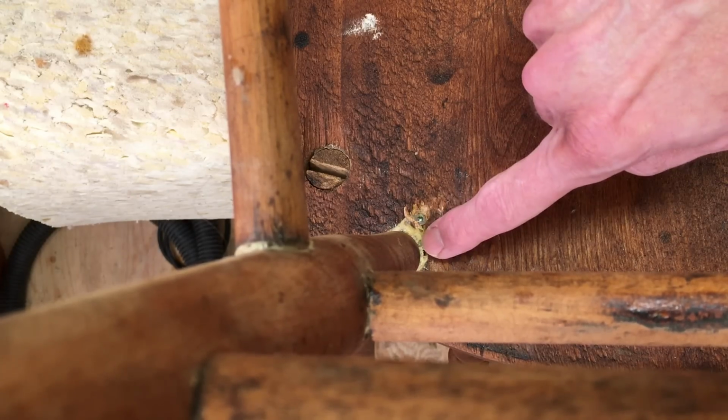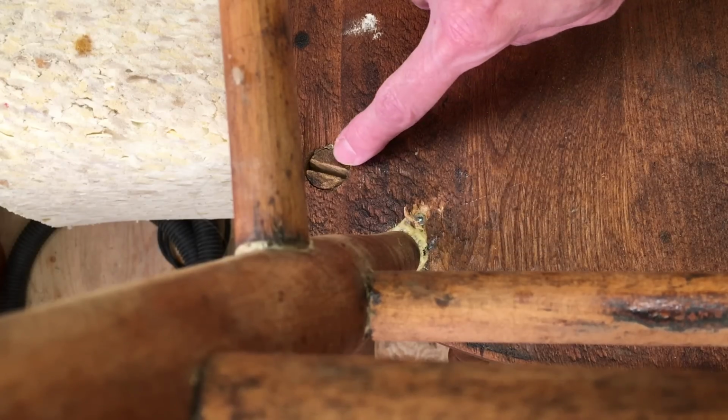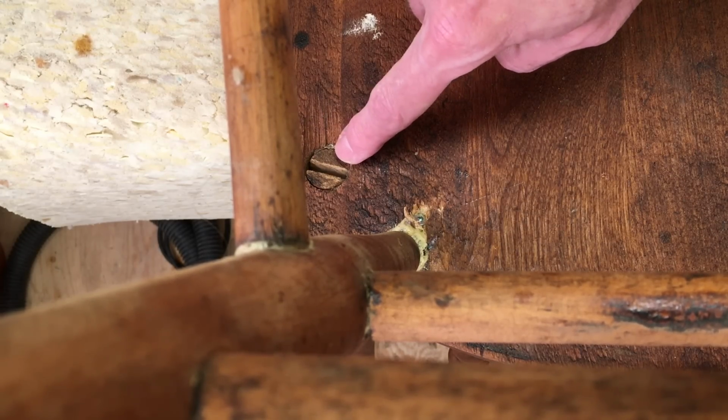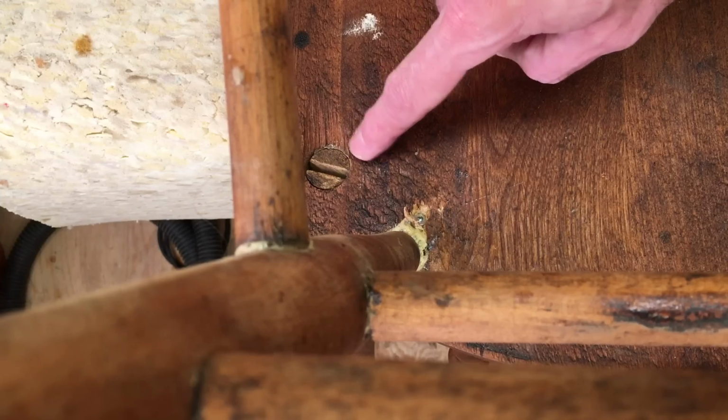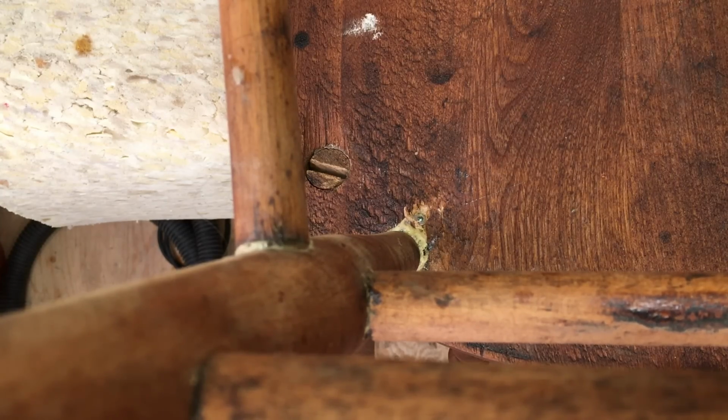There's a screw here in the leg, and screws should never be put in the legs of chairs. And here, there's supposed to be a wedge holding the back of the chair on, and there isn't a wedge. This chair will fall apart. So this wasn't a repair shop that knew what they were doing. Unfortunately, I've got a lot of repair work here to do.